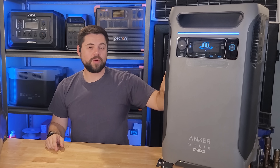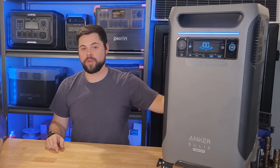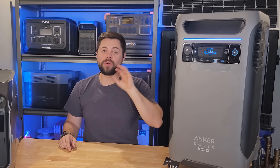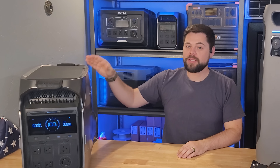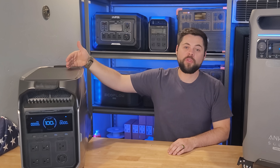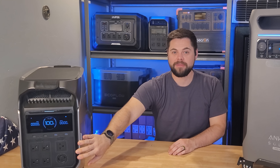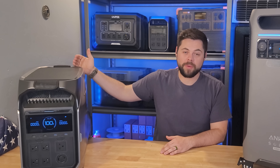There's one more advantage: when you're using 120-volt input on the F3800, you cannot get 240-volt output, and the 120-volt outlets are also reduced in available power. The Delta Pro 3, regardless of whether you're inputting 120V or 240V, gives full pass-through capability with zero limitation on output. EcoFlow is the only company that has figured out how to take 120-volt power in and get 240-volt power out.